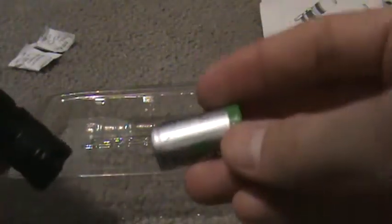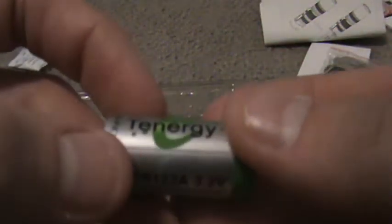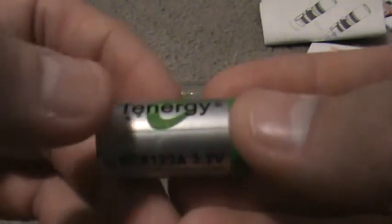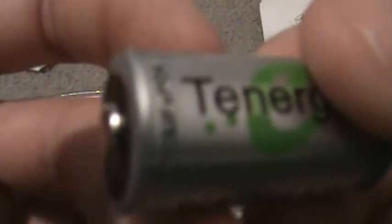This flashlight is powered by a single CR-123 or a rechargeable CR-123. Here are the rechargeable CR-123s I use — these actually aren't 16340s. The peak voltage is like 3.6 but it drops to 3.2 or 3 when you're done charging, so these are pretty much just rechargeable CR-123s.